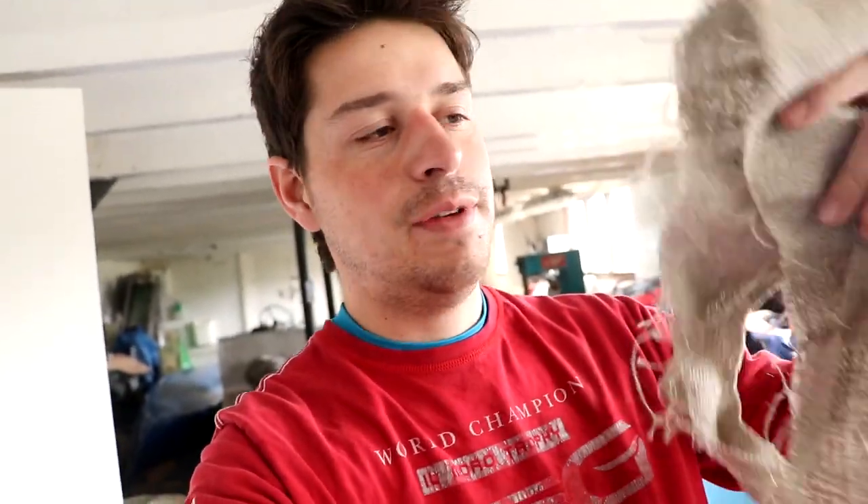Finally finished all the sanding work, really happy with that. Sanding is really not my forte, but now I have something really special. I have a special request for a flex fiber handle — so this is flex fiber, it's a natural material, it's made out of some kind of root, and they dried it. I'm going to cast it in epoxy with some extra layers, and it's a really beautiful material, I really like it. So first of all I have some G10 liners for some extra decoration, and I'm going to sandblast them and treat them so that they can glue up properly.